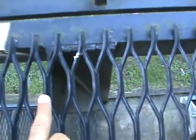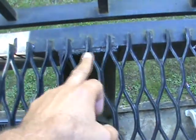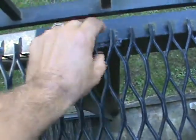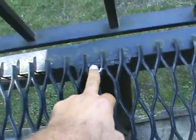Well, our main issue right now on a lot of these, for example, supports to the ground: either I have to do an x-ray on that, or as soon as I pop some bolts in here through the channel and seal this up with silicone on top, I've basically nullified the need to verify this weld. So in a lot of these connections, I'm going to show you from underneath.